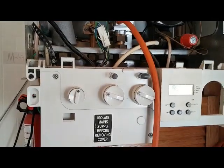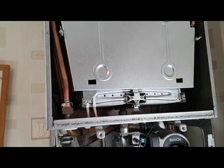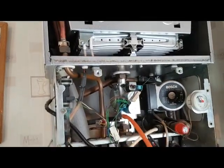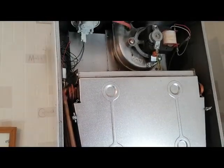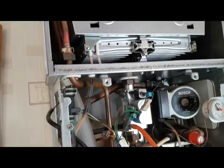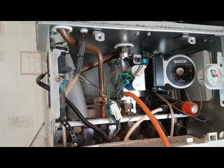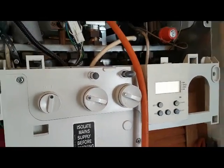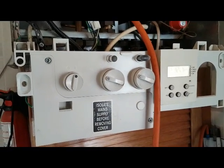If you've got any more comments, drop us a post. Pete: Obviously the air pressure switch and the fan to check as well. But obviously if it's firing up in central heating already, you know they're okay — or it wouldn't fire up in central heating either. Tony: That's true. If it was the fan or anything, you'd have a fault code flashing — a problem with the air pressure switch or fan gives you the relevant flashing light.